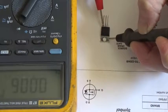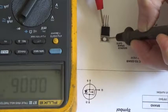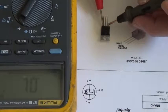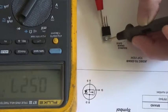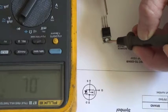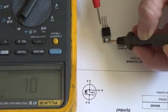0.0006 — I just turned on that MOSFET with my meter. Now to turn it off, leave your red lead on the source and move your black lead to the gate — I've just turned that MOSFET off. Going back up to the drain, we've got our 0.524 diode drop back, indicating the MOSFET is turned off.